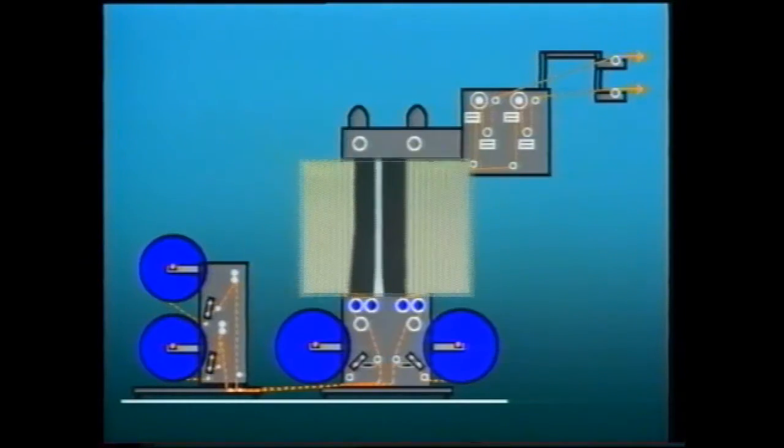By fixing the stretching ratio, it is possible to influence the quality and fabric weight of the article to be produced. With slight stretching, for example from 1 to 4, the tensile strength of the tape is low, whereas the extensibility is very high. With greater stretching, for example from 1 to 7, the tensile strength is increased and the extensibility decreased.